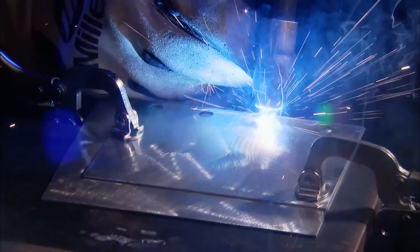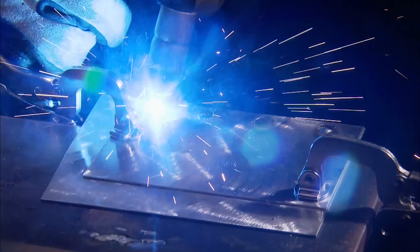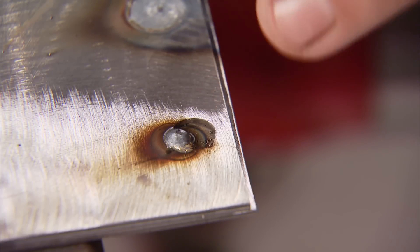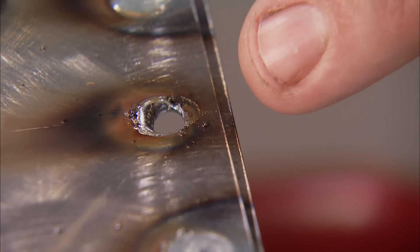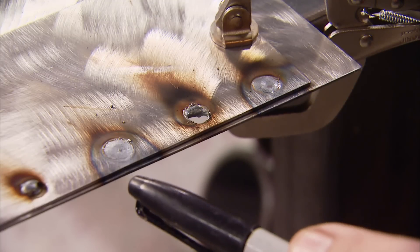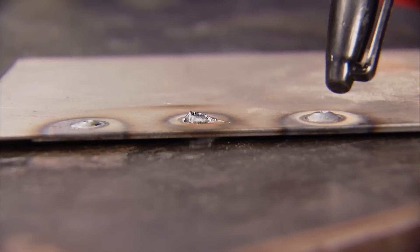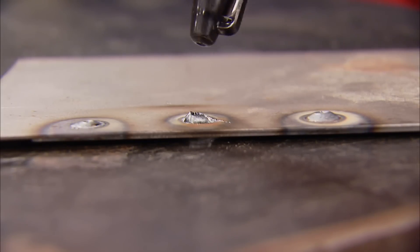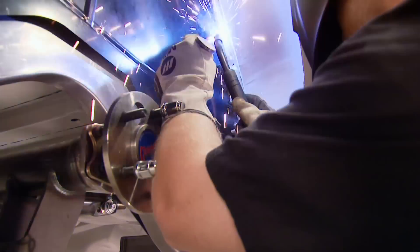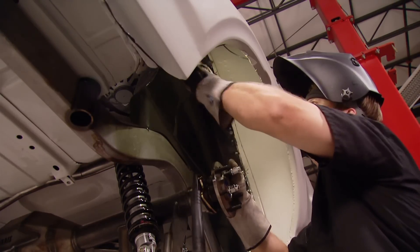Tommy will place a cold weld, then one that's a bit too hot, and then one that's a lot too hot, and then one that's just right. Who is Tommy — Goldilocks? The first one was a little bit cold because it's actually balling up before it burns in. This one is obviously way too hot because it actually burned through the bottom layer. Now these two both look really nice at first glance, but one of them is telling the story. The one that's just right is what you're looking for; the other one had heat too high and was just about to burn through. Now it's simply a matter of taking that technique and applying it to the tubs themselves. Once the metal is moved into place, welded, and the joint seam sealed, we'll have the same type of weatherproof connection as the factory would have had.